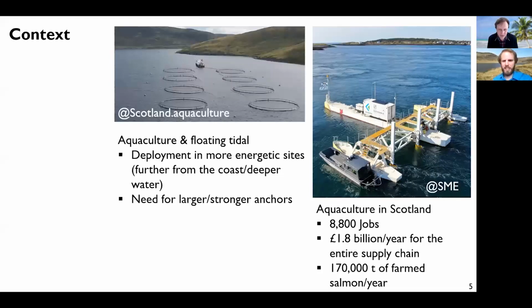Just a question that I'll actually answer myself. Do the interface properties influence the computational cost? I would say the answer to that question is no. The interfaces work, and as Benjamin indicated, they are really quite robust, so they don't pose any problems. I know a lot of users include interfaces even in cases where you don't strictly need them, just because it's not a bad thing to have. You can have interfaces with the same properties as the surrounding soil, so that will increase the accuracy of your solution. So interfaces between the foundation and the soil, for example, don't influence the computational cost at all.